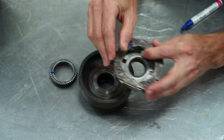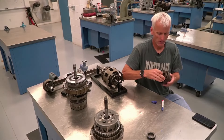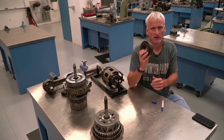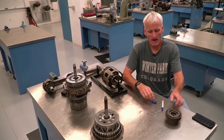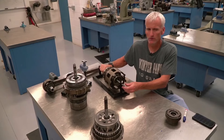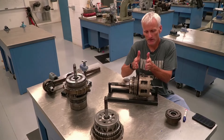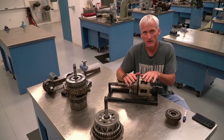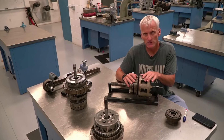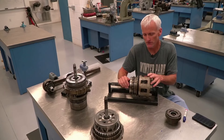So those are the six different combinations of underdrive, overdrive, and reverse gears you get with a single simple planetary gear set — sun gear, carrier, and internal. Not to say you couldn't make a very simple transmission with one planetary gear set, but they are more complicated than that. The simple planetary gear set is the general concept of what they do in these automatic transmissions, but they take it a step further and make a combination of gear sets. For example, in a 4L60E they've got a planetary gear set in the back and a planetary gear set in the front with common connections between them.